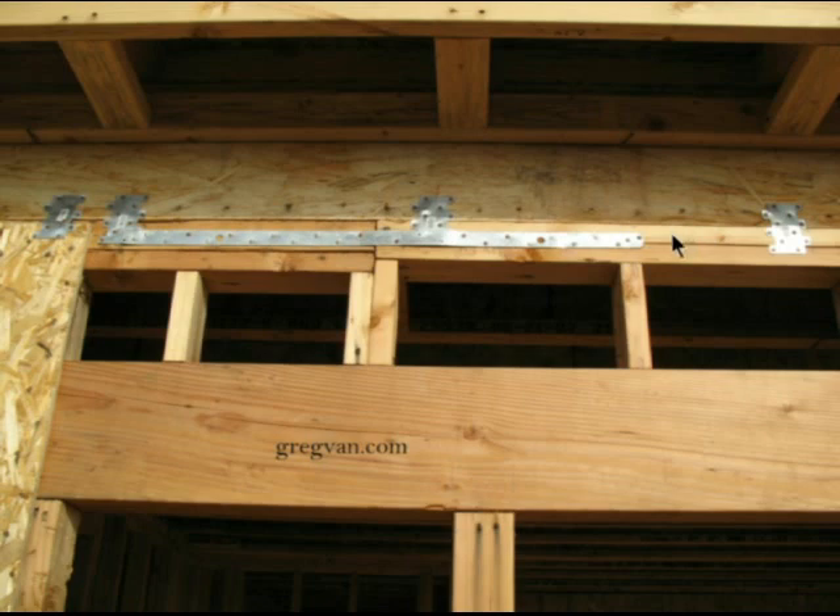I can see where a lot of this makes sense. Someone just says, I'm going to center the strap on the plate here, which is what most framers do anyway — they go ahead and center a strap like this. They're used to doing this. They'll center the strap between this point and this point. And that's, I think, what they did here.